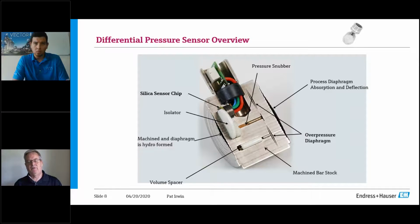It's typically the improper cycling of the three-way valve manifold. A three-way valve manifold or a five-way or two-way manifolds, they all have dual purposes, but let's focus on the three-way, and the five-way qualifies with it. It's just two additional valves. But when you deal with a three-way valve manifold, the purposes for it are two things, isolation and calibration.